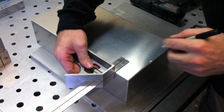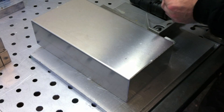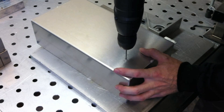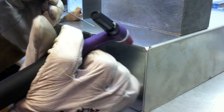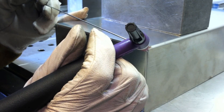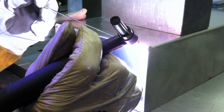You can see a tack on each corner and one in the middle, and Roy is laying out a hole to be cut later. He's coordinated with the manufacturer — they'll need to drill a bigger hole because when you seal up a unit like this, if you don't have a vent hole or weep hole for gases to expand, it can blow the weld out. It's always good to communicate when doing work for machine shops — let them know there may be pressure buildup and ask if any holes or ports will be machined later so you can drill a small pilot hole to let gases escape and keep from blowing the weld out.